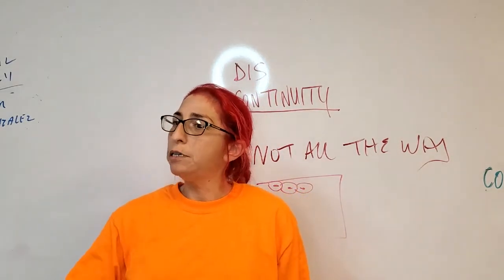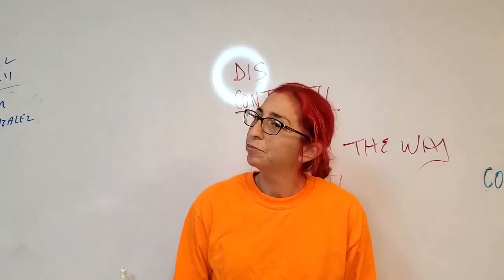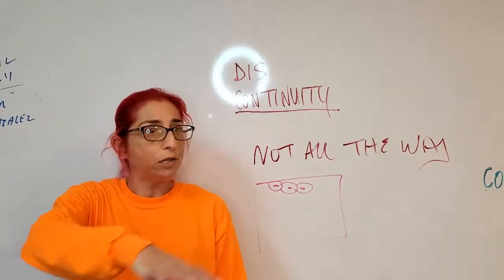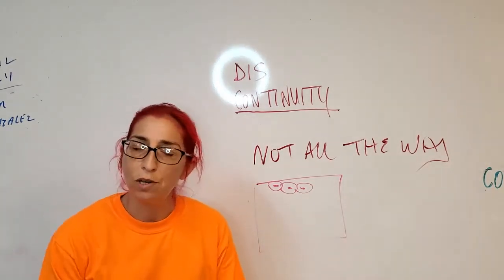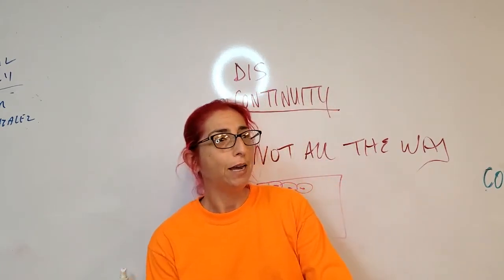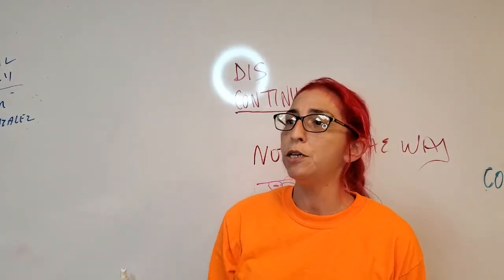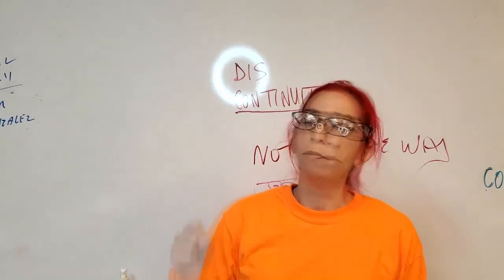If you do not grind it out fully, Val, what happens? It continues to travel on up every layer. Val had a little bit of porosity right near one of his base layers. He's on the top, just about the top layer, and he still has porosity in that same spot. For some reason, when we slap another weld on there, it doesn't fix it. All it says is, oh hey, gas bubbles, come on up. Here I am, and it really makes a problem. So in order to fully remove it, you must grind out the porosity. Putting another bead on it doesn't fix it.